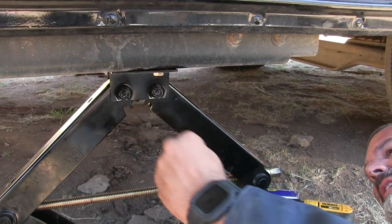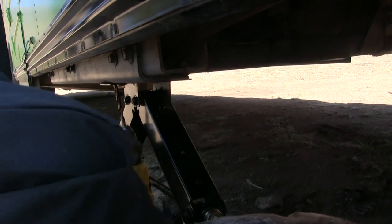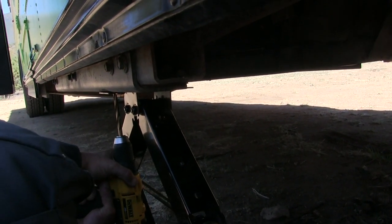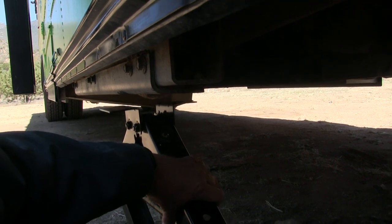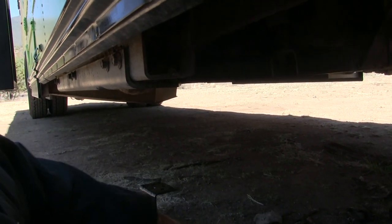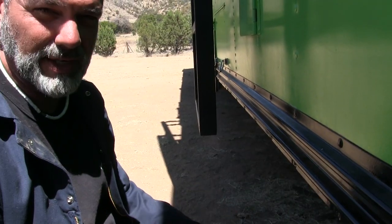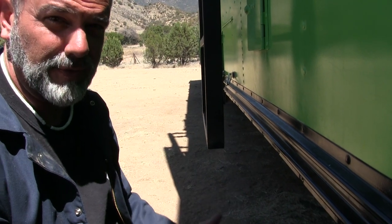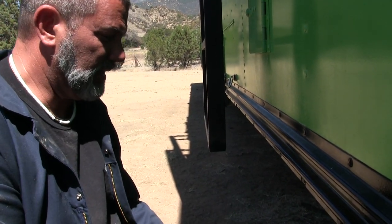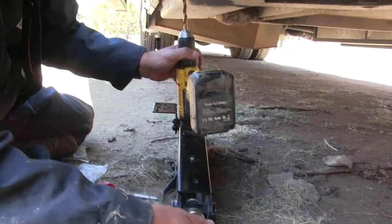It works! There's a magnet here that pulled the bit out. Now that it's in place with one bolt, we're going to use the drill to mark the locations for the other three bolts. We're actually going to put in the second bolt completely before marking the last two places because it's wiggling around too much. You want to use cutting oil when doing this — it's really important. This drill bit is designed to go through steel, but if you don't lubricate it, it'll get extremely hot, change the temper of the steel in the drill bit, dull it fast, and you'll be buying a new one.